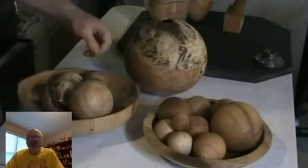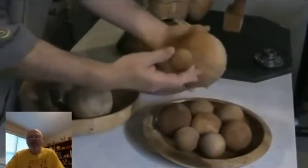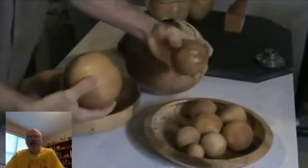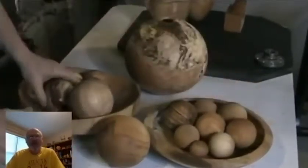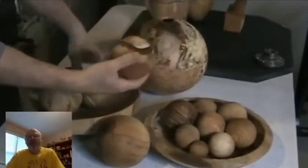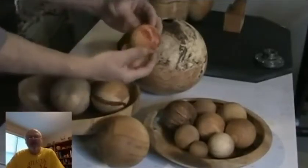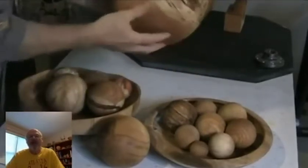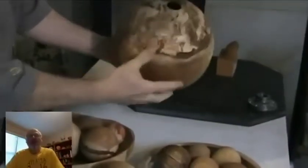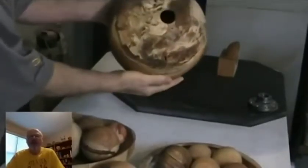Most of these spheres are solid. They range from a little bit bigger than a golf ball to a little bit bigger than a softball. These are all done on the lathe, at least part of it done with what I'm going to call method number one — cup centers. That was a burl piece with a bark inclusion, and spheres look nice to show off the defects in the wood. The large one on the back I hollowed out and I'm letting it dry; it did lose some of its spherical shape and I haven't decided if I'm going to re-true it.